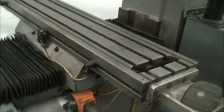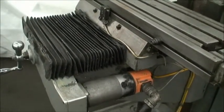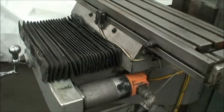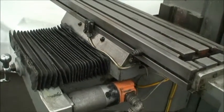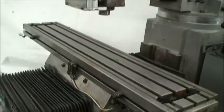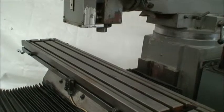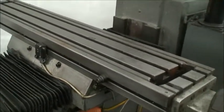These have nice box ways — very rugged, heavy duty. The quill travel is 15 inches, which is the Z. Maximum distance from the spindle to the tabletop is 49 inches. Table load capacity is around 700 pounds, actually 772.